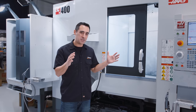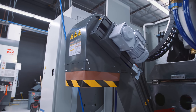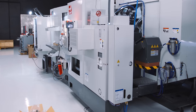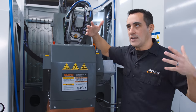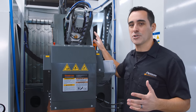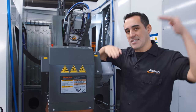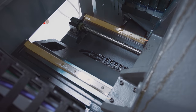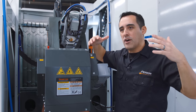Let's walk. We've got a lot of panels open and I'll give you a peek inside. Here we are on the right side of the machine — kind of the back side. You have the chips that come out, the utilities. The electrical cabinet faces the operator and you have the air cabinet. Back behind me is more guarding of the hundred tool carousel. Now that there's a panel off, one of the things that makes horizontals so rigid is Haas uses a step design — the linear rails are not on one plane, they're on two different planes.